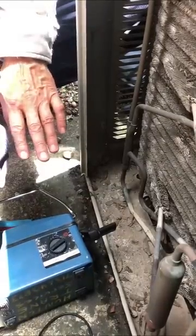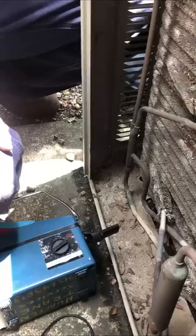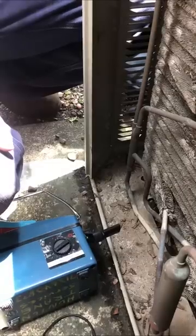Just for an example of how this can be misleading, you can go to an AMC and you'll have a ground fault on the VFD. You can measure to ground and you may be getting 500,000 ohms. Well, the motor may not necessarily be bad — in that case the windings may be wet. Typically what you do is take the VFD offline, run the motor direct, and let it dry itself out. Because the VFD is sensitive enough that it will give you a ground fault. Then after you run it for a period of time and make sure it's dried out, you hook the VFD back up, take it out of bypass, put it in run VFD, and it should go away.